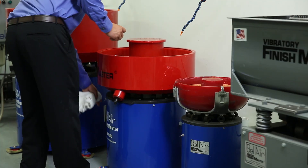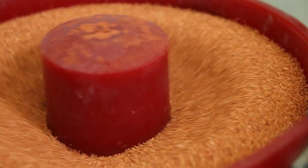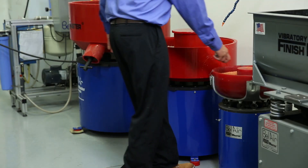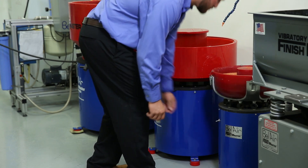For most parts, we can achieve 70 to 100% of the necessary wet grinding and/or dry polishing operation. The process time is three to four times that of high-energy finishing, but more effective than 2D tumbling. This method is a little tough to automate and has limited ability to handle complex geometries.